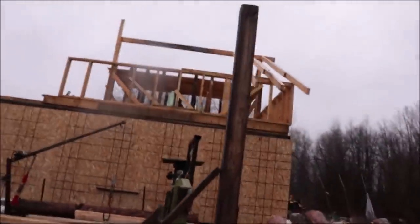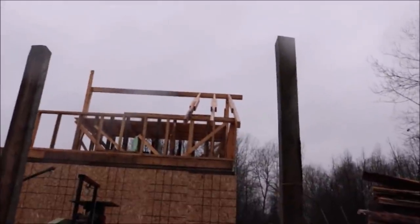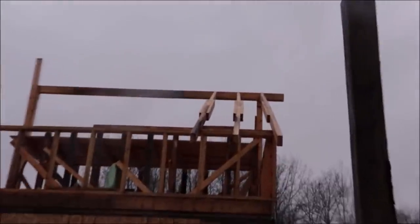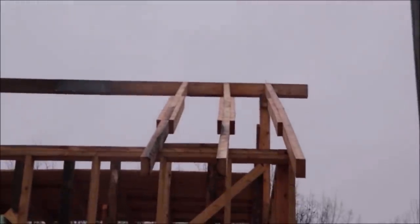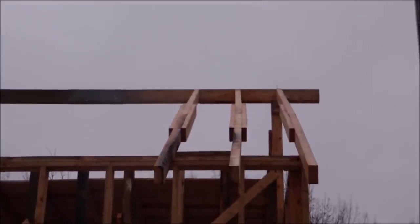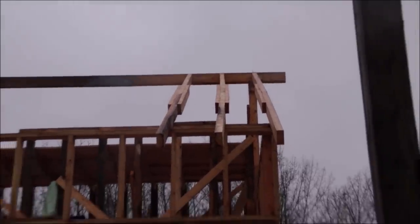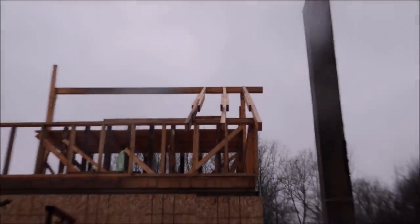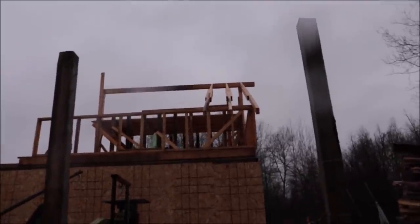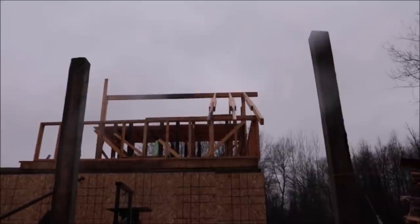Right there. There we go. Can I zoom in without getting my hand in the way? That's what they look like. They will get straightened up as I do the strapping up there, but they're pretty strong. Just over 8 foot rough 2x6 on either side of them sandwiched, and those are 3x6 running up there, and they're on 2 foot centers, so we use that block in between.